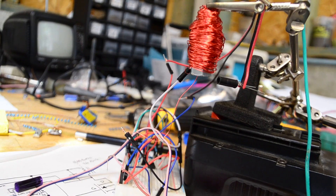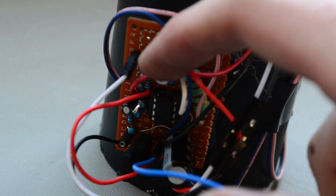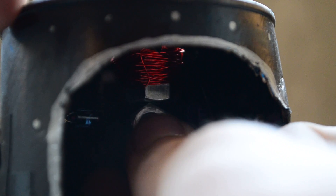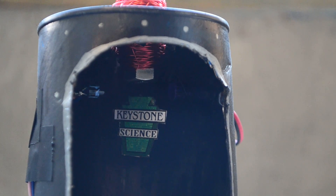Now that we know everything works, I'm going to go ahead and clean it up a bit and put it into an enclosure. Now I have it all complete. As you can see, I have the electromagnet, the infrared emitter, and the infrared sensor all inside of the chamber, and all the circuitry has been added to the back. I also added a potentiometer just to adjust the sensitivity of the infrared sensor — it's in place of that 4.7k-ohm resistor we had. Let's go ahead and fire this thing up and give it a test run. Once we flip it on, all we need to do is stick the metal piece up into the beam. It can be a little tricky to find the right spot. And there we go. I pushed it a little bit and it will just sit there spinning and spinning because there is so little resistance going against it. I put my channel logo on a piece of metal and it can just float inside of it.